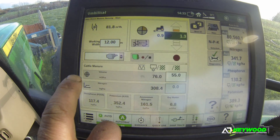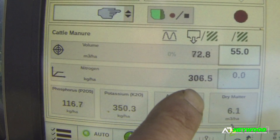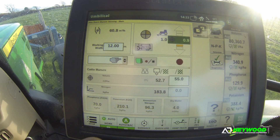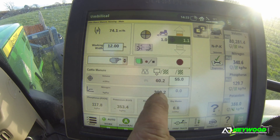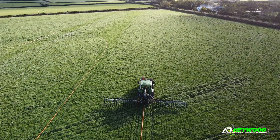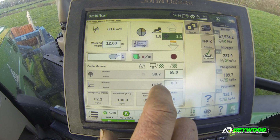You can set your parameters — I could have nitrogen on there, so if you said you wanted X amount of kilograms or units, you could set that one into that one and it would then do the same principle. It would only put on whatever you wanted out of your slurry. You could be putting 100 kilograms of nitrogen on, but at whatever flow rate it could be 1,000 or 3,000 gallons to the acre, depending on what your potency is. You can set your nitrogen into your volume and then only apply whatever you prescribe wanting on your fields.